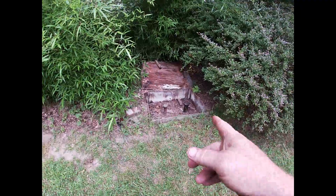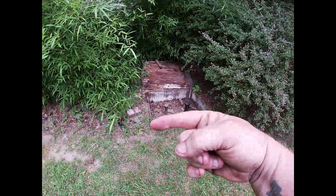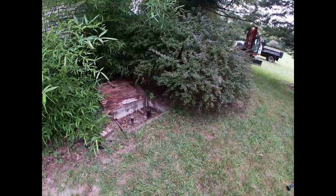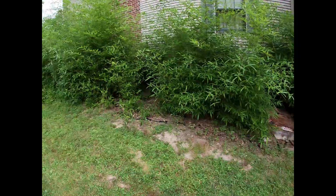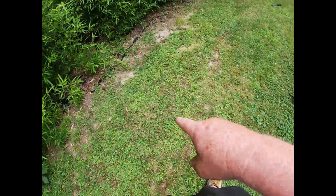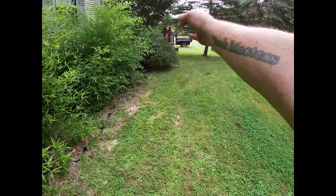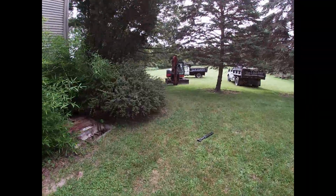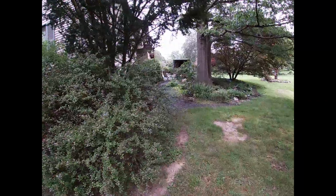So, you know, as always, you never know which way they lie. It either lies here, goes 11 feet 6 inches that way, or starts here, 11.6 that way. So if it goes that way, I've got these trees, that bush that I have to take out. She doesn't care about any of that stuff. So great access as far as doing a tank removal. So I'll sit right about here. I'll dig. I'll cast my overburden over here, and that gives me room to back my trucks in when I backfill. So we'll go see the install location right now, where they're installing two 330 gallon tanks manifold together.